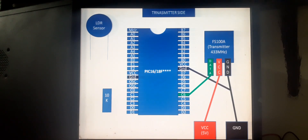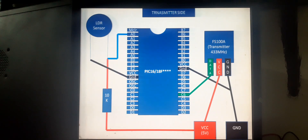For the LDR sensor — it has two legs. We connect power indirectly to the LDR using a 10K resistor. The other leg of the 10K resistor connects to the LDR, and from that same junction we take our output to pin A0, meaning ADC channel 0. The other pin of the LDR goes to common ground.